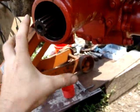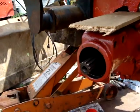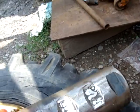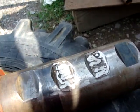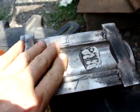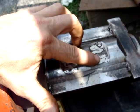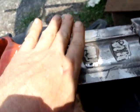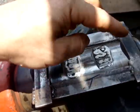This is round two or three of repairs. I used this as a guide — brushed it, cleaned it, sanded it, got it all clean, put in the weld, then used this as a guide to hand file it. It's the only thing I could come up with. I found a file that fit between the parts, hand filed it, and test fit it.